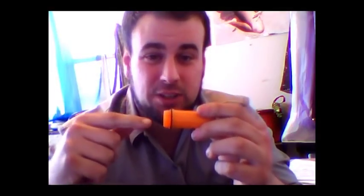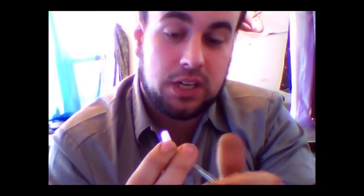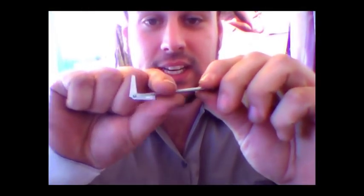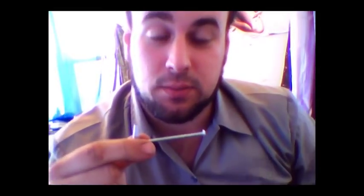If you have a situation where this is all plastic — your light fixture, your lamp — then you're going to want to use the back, and you're going to drill a slightly bigger hole that will receive your toggle bolt. You just have this device on the end; it screws on here, goes through whatever you want, goes through your hole, closes down, fits in, and then opens back up inside.